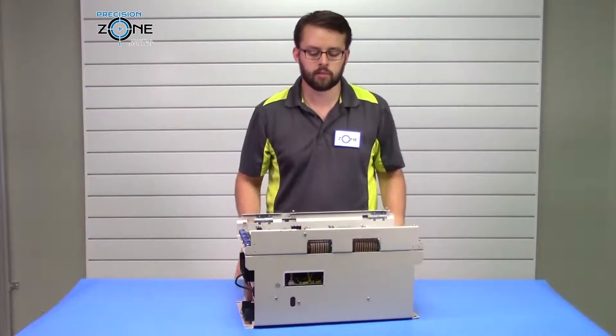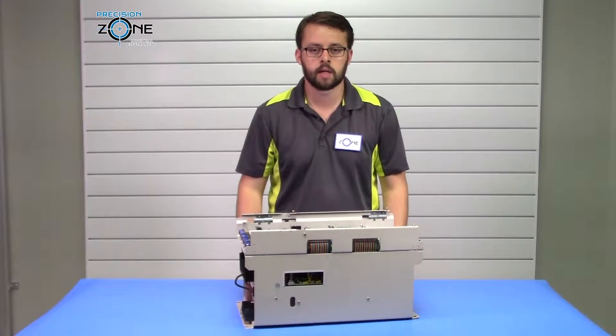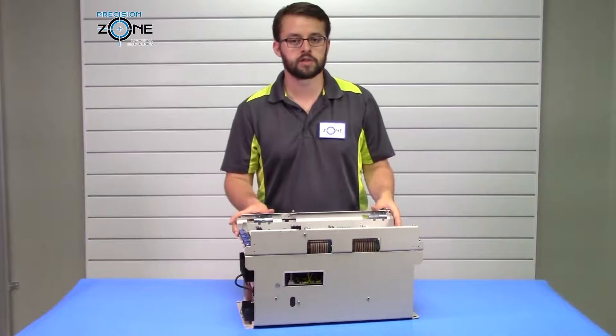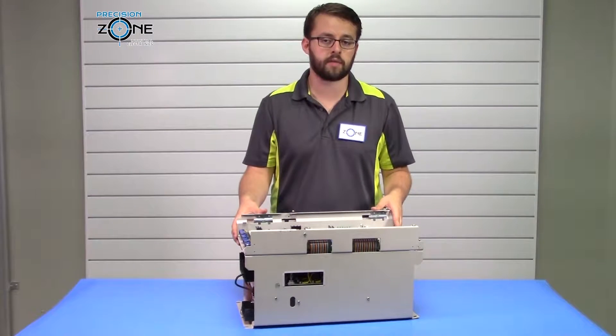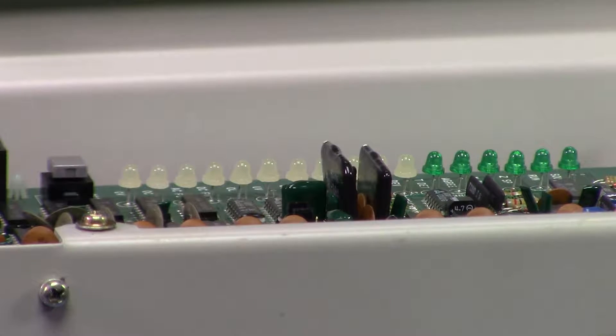Alarms that you can receive on these drives would be if you're having issues with your braking — say an over voltage on braking. That likely indicates you have an issue with the regen section of this drive. In that case, there's not much to do on-site; you would need to get that drive repaired.